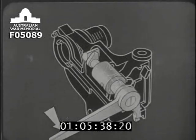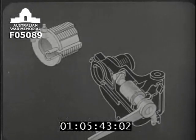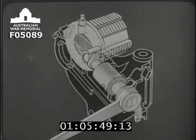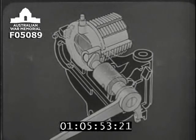Here is the lever breech mechanism, or LBM. On the breech screw itself is the crosshead boss, which will fit over the crosshead when the breech screw is in position on the pintle. The carrier, which has now become solid, is supported by two lugs on the breech ring and can pivot about a pivot pin between them.